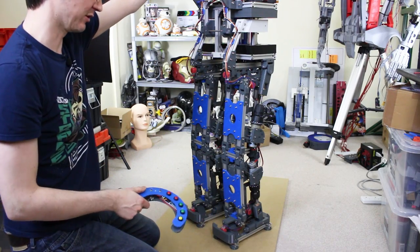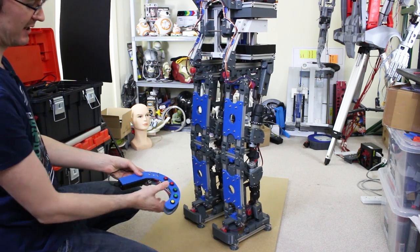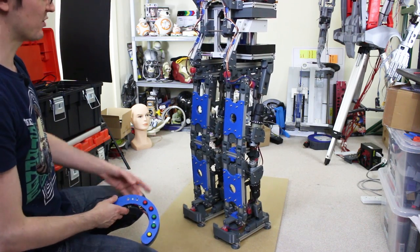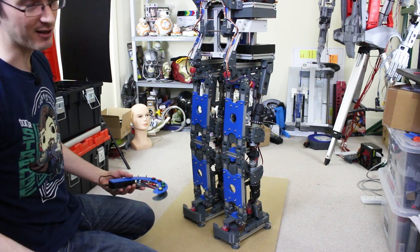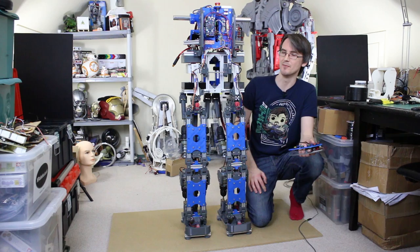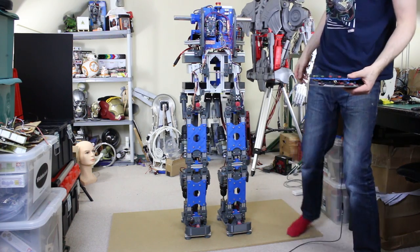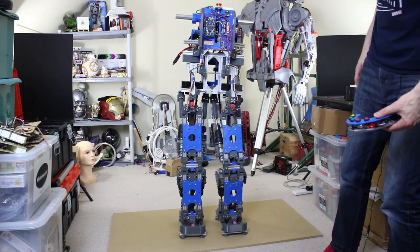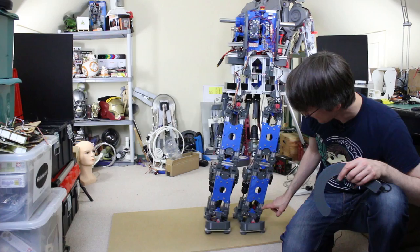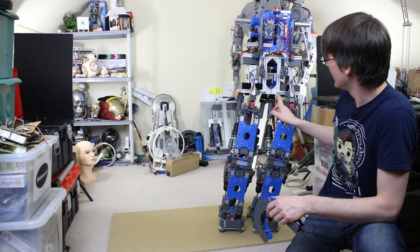Now I'm going to try to get it to take a foot off the ground — you can see it's shuffling along and not putting full load on one foot. I've done a bit more code to bend the legs: in angle mode, pressing the green buttons bends one leg, and it returns to position when it reaches the target — a state machine using actual joint angle and motor speed rather than timing. I've now coded those leg lifts into the main state machines. It has to move its whole mass sideways to get a leg off the ground since the legs weigh quite a bit, but it almost works.